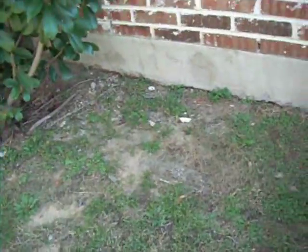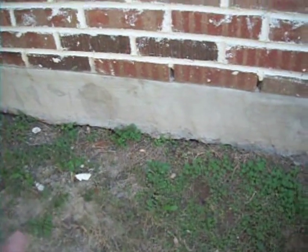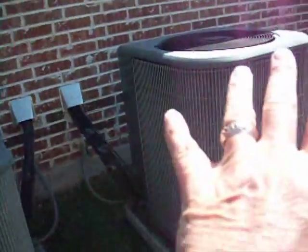This erosion is quite considerable here at the back. The roots — this tree's not helping, it should be taken out. You'll see that the ground is dropping away. There's parging here; this is a Portland cement that's put over the foundation to seal it. There's no real great concern if it breaks off, you can easily replace it. It's been eroding and run off here. You've got the diverter, which diverts the water coming straight down onto here, and the diverter is there to protect the air conditioning units.